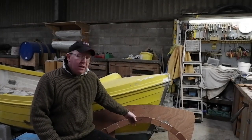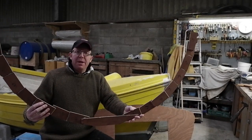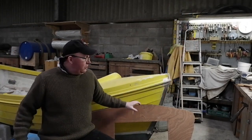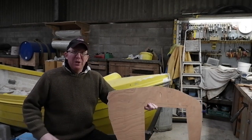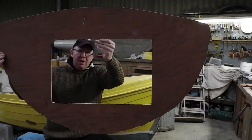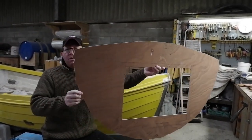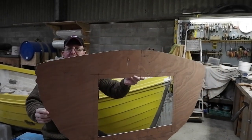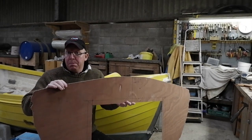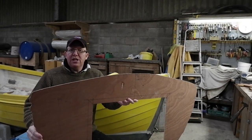Once I had the initial pattern copied out, glued together, and ready for fitment, we had to transfer this onto another piece of plywood to make a whole template. And this is your outcome — it's got the exact shape of what we need. Before we make the bulkhead, you transfer this onto your 12mm marine plywood, draw around it, and cut it out with the jigsaw.